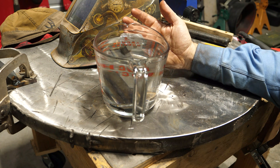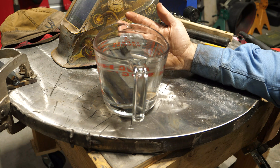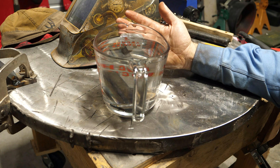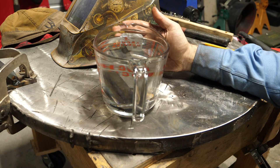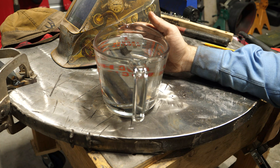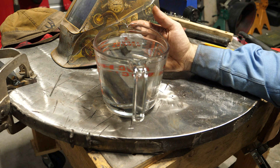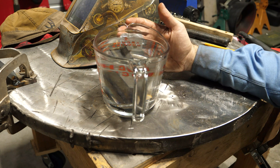This product is not tested or specified for anything. So is it a good idea to use that flux core wire to weld on a high-strength steel? No, definitely not. I would not recommend it, just like running 6010 or 6013. Stick with your gas-shielded MIG or a wire that's specified for welding that stuff. If that was hydrogen escaping, it was a lot less than there was on 6010, that's for sure.